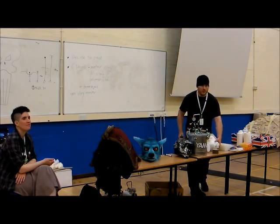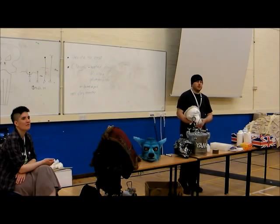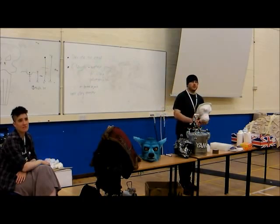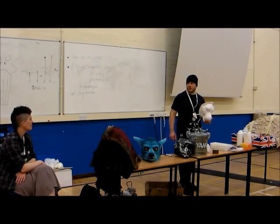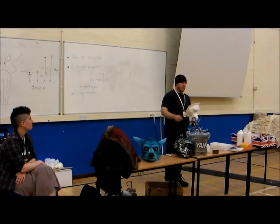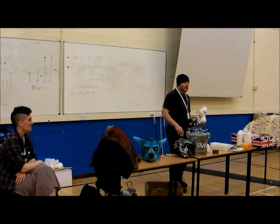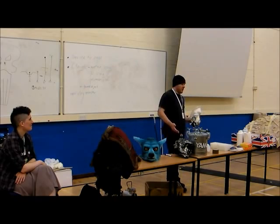You also want to be careful how much catalyst you put. When you put too much catalyst in resin, you get a hot mix, it catches fire. You don't get that with silicon. Silicons don't heat up, do they? No. You can put platinum cure silicon straight on your skin and let it cure. Tin, don't do that. It's a really bad idea. It will actually poison you a little bit. It'll just give you a really nasty rash, basically. It's got a lot of really potent alcohol in it and stuff like that.